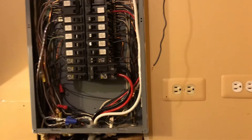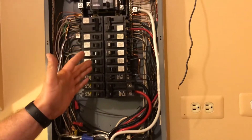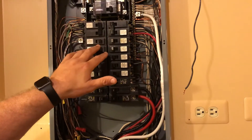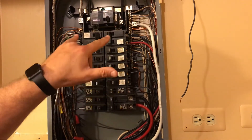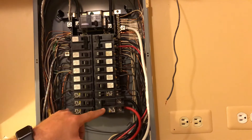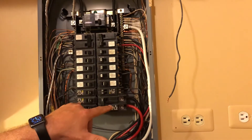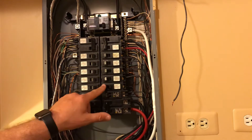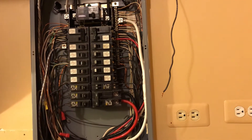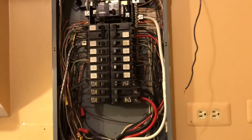The first thing you want to do when you do this is, if you're not a trained electrician, shut the main breaker off to the panel. That is still going to leave these two legs hot, but everything from here down will be disconnected. As I've said in previous posts, I'm a master electrician, so I'm used to dealing with hot circuits and I know what to watch out for.